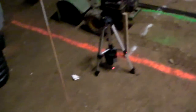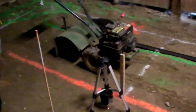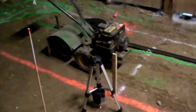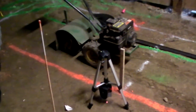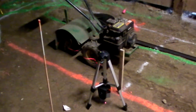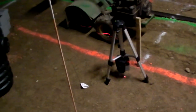Here's my laser level, and you'll notice it's upside down. I trimmed off the stop off the end of the vertical piece and I flipped it — I inverted it — so that the laser can actually run a fraction of an inch above the surface of the ground. Then I calibrated the base very carefully so I can use the bubble level on the base as my X-to-Y reference. I look at the lines and use the legs of the tripod to get that set, and then for any minor tweak I use the screw adjusts on the level itself. You can see the glow dot on the bottom, which would normally go straight up, but that gives me my reference to this point.